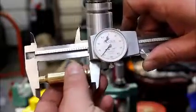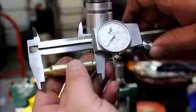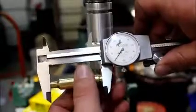Every one, no matter the length. Measure that one first — that one is already about two thou long. A touch long. Ten thou on that one to come off. There we are.